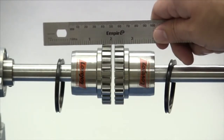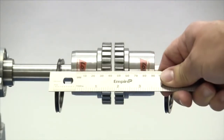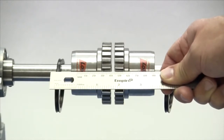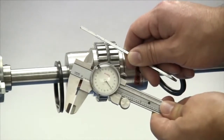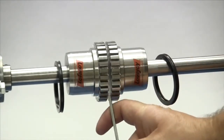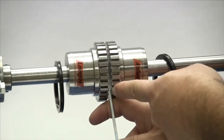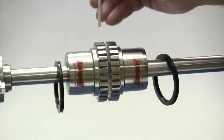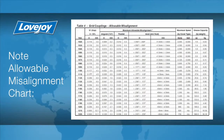To check the basic alignment, start by laying a straight edge across the major diameter of the hubs. The maximum allowable parallel offset should not exceed the amount for your particular coupling size as specified in the installation guide. The angular and axial alignment can be checked using either a spacer bar or vernier calipers to measure the gap between the faces of the hubs. This measurement should be taken as close as possible to the edge of the grid teeth at four different locations around the coupling: 3 o'clock, 6 o'clock, 9 o'clock, and 12 o'clock. The difference between any two of these measurements should fall within the range specified in the installation guide under the heading angular. If the deviation exceeds the angular value specified, you will need to realign the equipment to correct this condition.